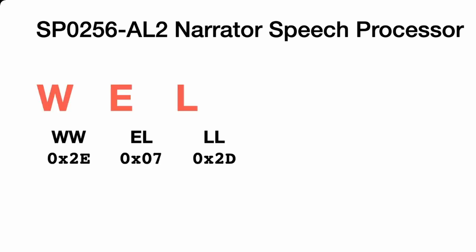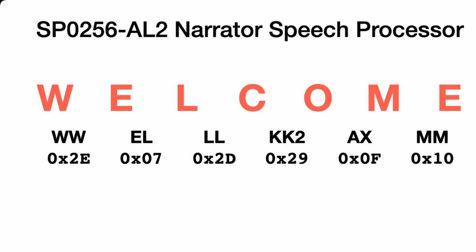For instance, if I would like to say the word welcome, I can use these 6 allophones. These 6 allophones have a particular English text that goes with them to symbolize the approximate sound, and also the hex code needed to play that allophone. And when they're combined together, I get...